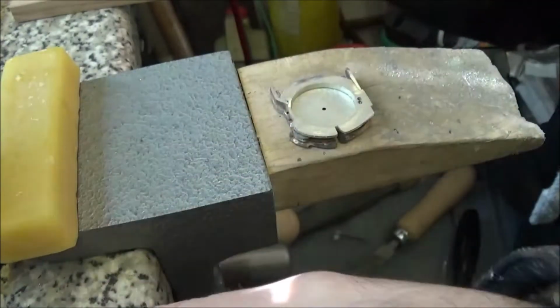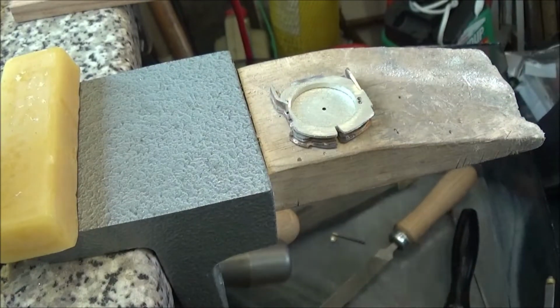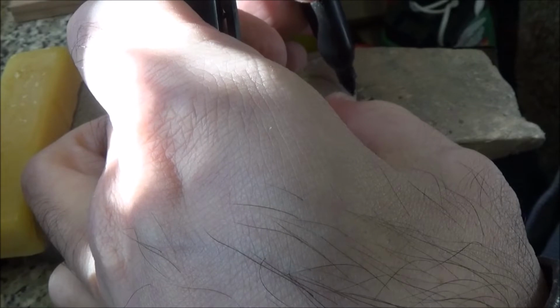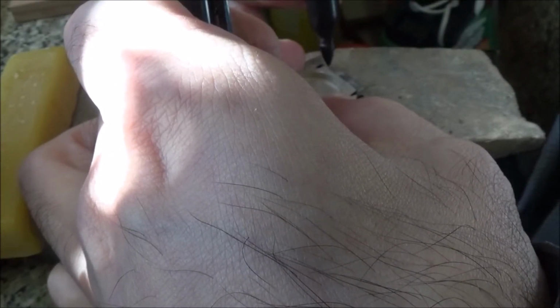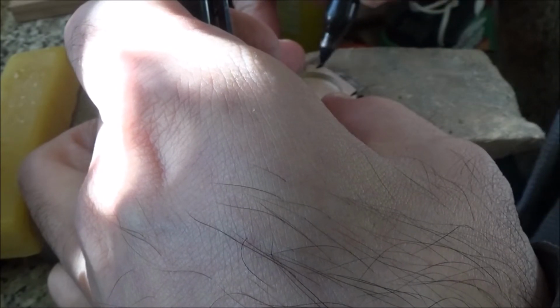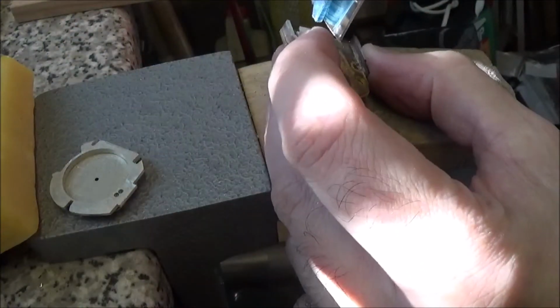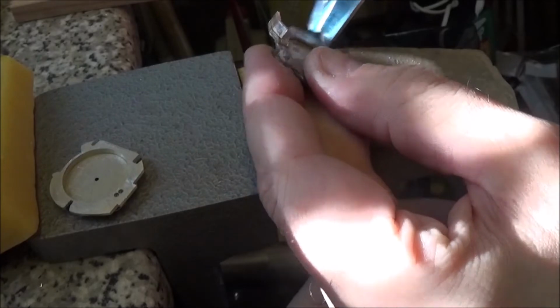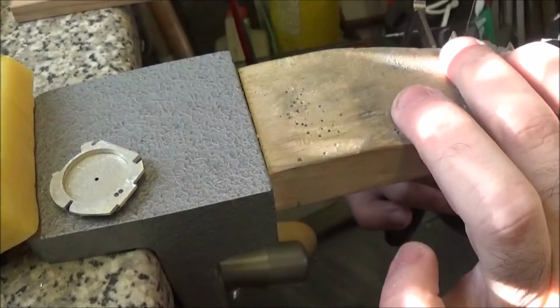Yeah, this was slightly tricky, and the piece of metal has been heated up and soldered so many times. I keep trying to use hard solder, because you have the option to go down and use medium or easy when things start getting difficult, but you haven't got the option to go back up and use hard again if you've already used medium or easy. But regardless, as I'm soldering this, other parts of the case are starting to open up and gaps are starting to appear, and the heat has warped a couple of things, so it doesn't fit together as nicely as it did. And so basically I don't want to solder anymore on this.